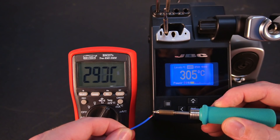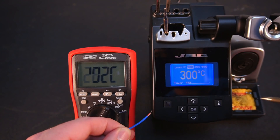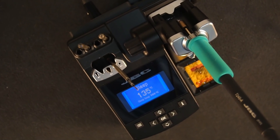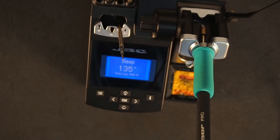According to the display there is often a 5-degree overshoot, however it recovers so quickly I doubt anyone will care. And perhaps a firmware update would correct this slight overshoot anyway. Safe to say, if you can justify the price tag you won't be disappointed by this JBC soldering station.